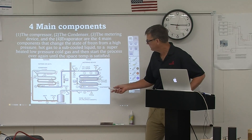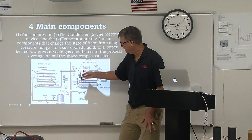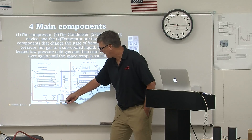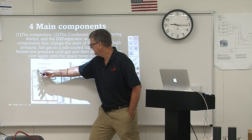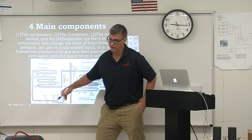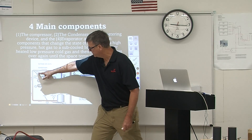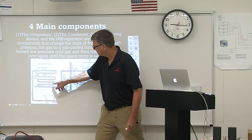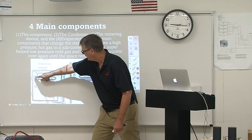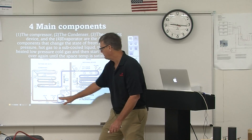Here's basically the same thing, but it's actually giving you the temperatures. Here is the hot gas leaving the compressor and getting into the condenser — you can actually see the change. It's 125 degrees Fahrenheit because of all the heat we picked up from the space. As we remove that heat, we might leave the compressor at 200 degrees Fahrenheit.